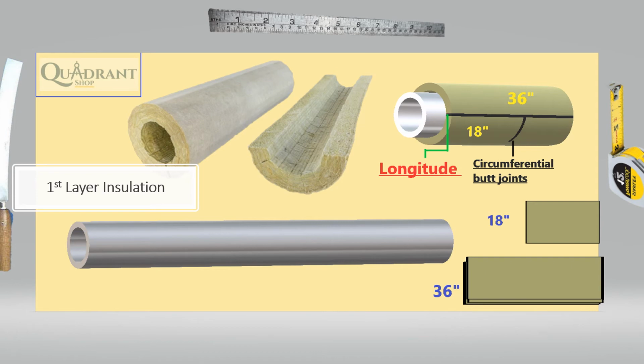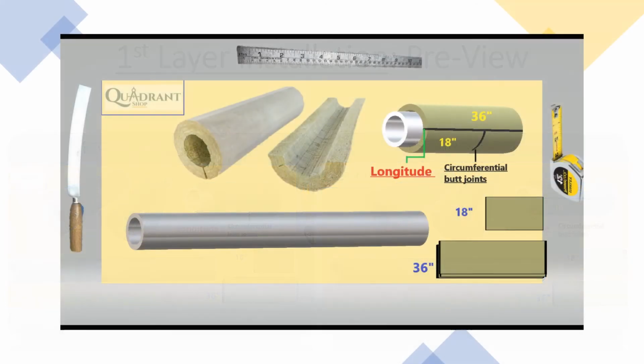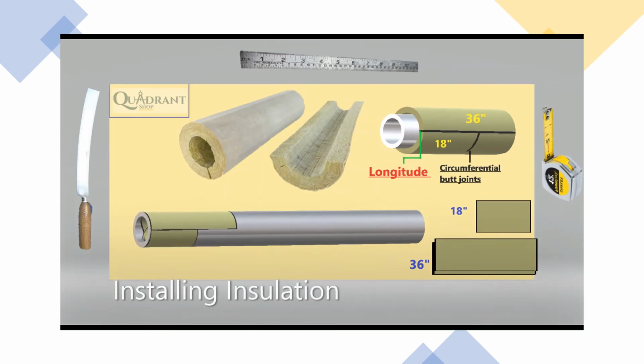So real quick before I play the video, for single layer purpose, right? So basically what we're gonna do here for a single layer, keep in mind that we have to install this at your 3 and 9 o'clock longitudinal, right? All voids, circumferential joints must be tight and sealed, right? No voids.